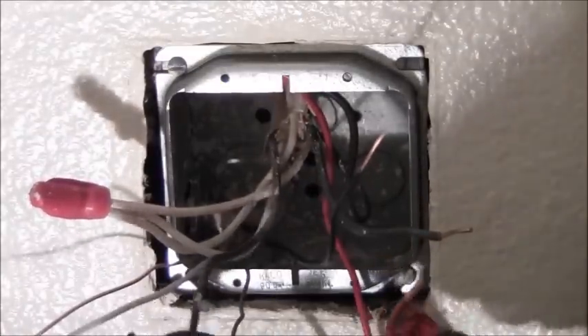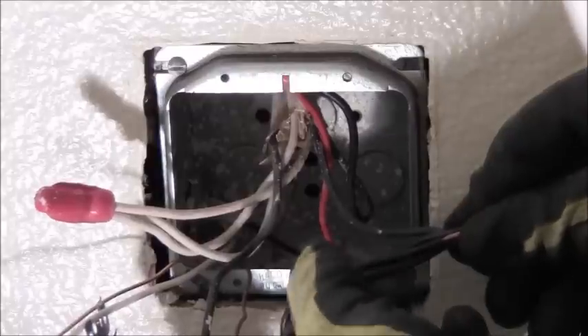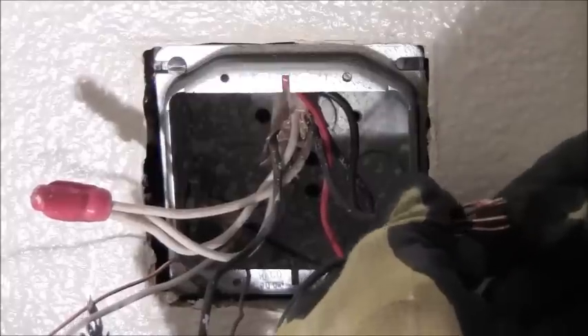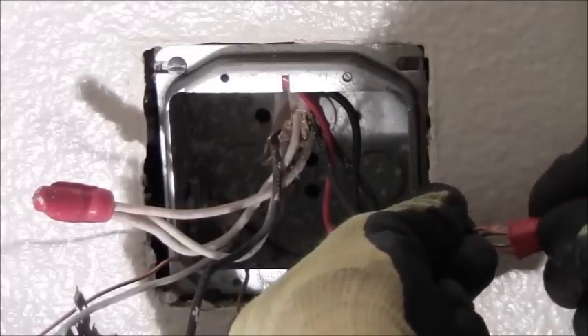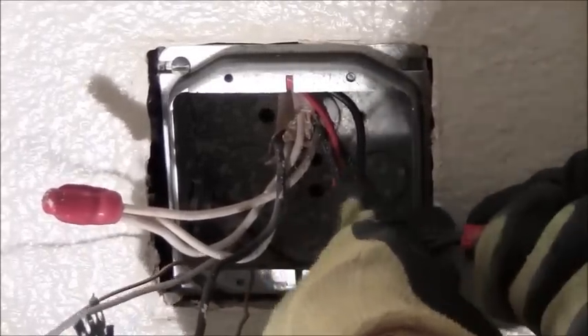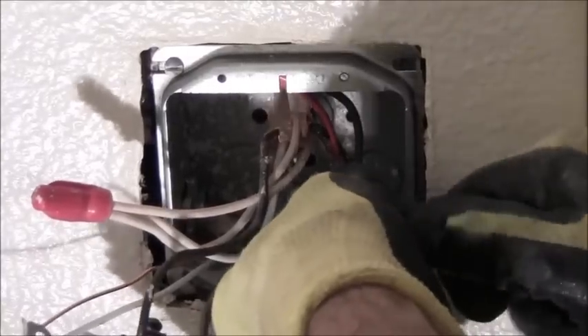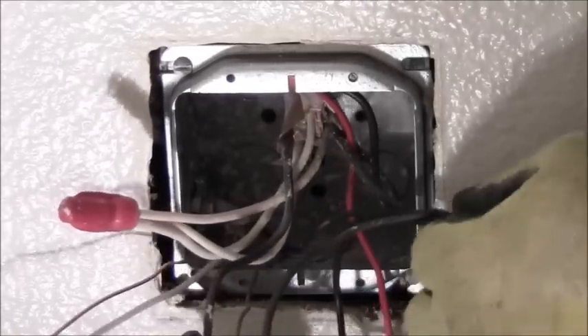It's four conductors — I want them all the same, equal coming out. It takes a few minutes — you want to get this right so that they all grab good. I'm going to twist that and I'm going to wait until I get a good curl here coming back. Once I know that I've got a good curl coming back, I know that I'm in the wire and that's really good. Plus I'm going to try to pull that — that's a solid connection.